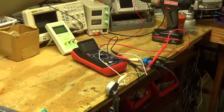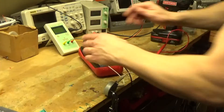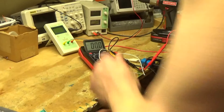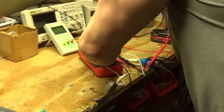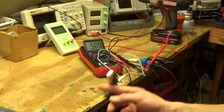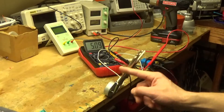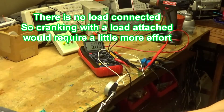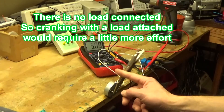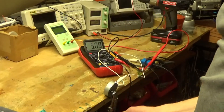That's hooked right into my multimeter. Let's just see if this thing will generate the five volts we need — there you are, we're already at five volts. Very little effort to spin this thing to generate five volts. There you go — it's a phone charger hand crank made with used parts from a microwave.